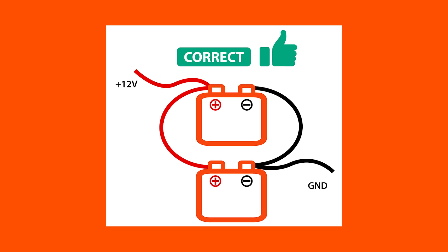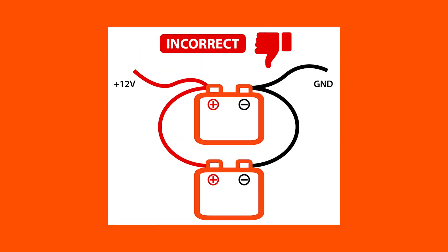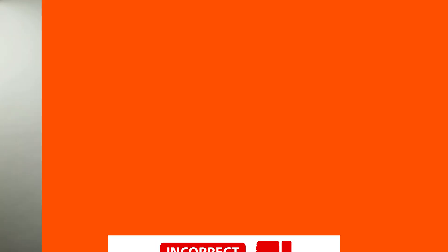Lastly, we see a lot of issues with parallel daisy chaining of batteries not being connected properly to their charger. When daisy chaining batteries in an energy storage system one-to-one, you must always make sure that the positive end connecting to the charger is taken from the opposite end of the battery bank as the negative end. This is to ensure that all batteries receive the same charging voltage while charging, and also ensures that the battery charger can follow its charging profile most accurately for the whole pack. If you connect the positive and negative ends of the charger to the same end of the battery bank when daisy chained, the battery at the end of the chain will always see a lower charging voltage than the first, due to the voltage drop across the wires on the way.